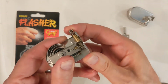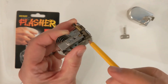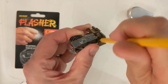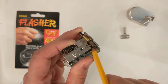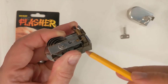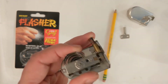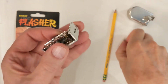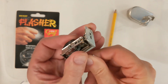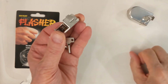You notice this plunger and the little metal tab that's coming out, that's attached to the plunger. If that metal tab gets bent out over time, flattens out a little bit, either this way or this way, whatever, then it might not have enough bite to lock that wheel down. And if it doesn't, when you wind, that spring will just constantly be expanding and never tighten up. I'll show you what I mean. Let's just pretend it's flattened out. I'm going to push the button down to simulate. So I can wind. See, it just unwinds constantly.